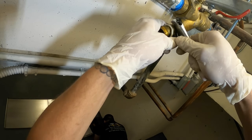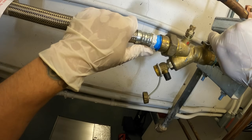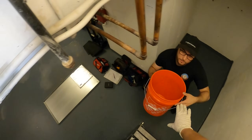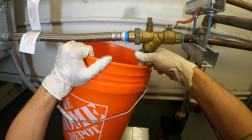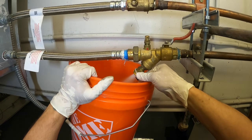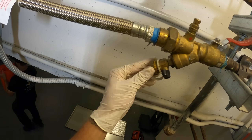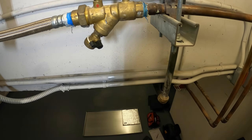I'm just going to put this back. You don't need Teflon tape or anything because there's actually a gasket on here, so you know you're going to be good. Setting that by hand — you just need to tighten this a little bit. Close this and open the lines back up. Maybe bleed this thing out a little bit — some air. Let's just bleed this out a bit, even though it is going through the cooling tower. Man, that's a lot of pressure. Dry it down, make sure there's no leaks — and the strainer is clean.